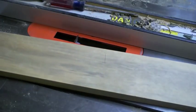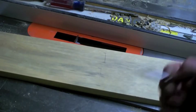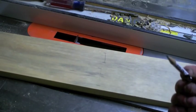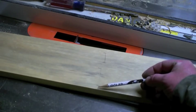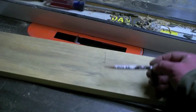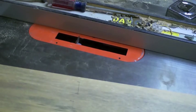What I'm going to use this cutter for today is to plow out the back side of window casing trim — from about here to about here, and then from about here to about here. This way, when the casing sits against the wall, it'll only touch at three points. When working with houses, they're just never perfect. This way you have much less material actually touching. It also makes it easy to plane and scribe your lines, because you're only cutting about a half inch on each edge rather than trying to plane the entire width of the board to fit. This is basically standard as far as casement work is concerned.